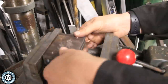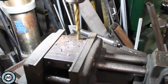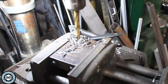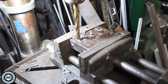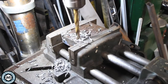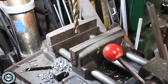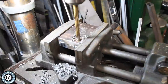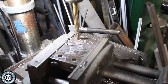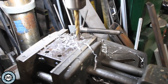By drilling these out with the tap size first, I know that when I ream out the hole to the clearance size it'll be perfectly registered with the piece below it. I'm drilling through one inch of material using plenty of drilling lubricant and just taking my time in steps. You can put enough pressure drilling like this to break the weld, so I want to make sure I'm really careful — I also don't want anything spinning and binding.